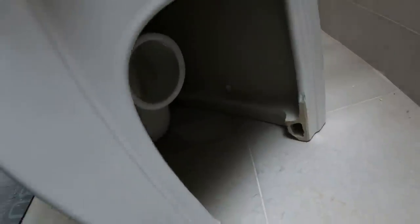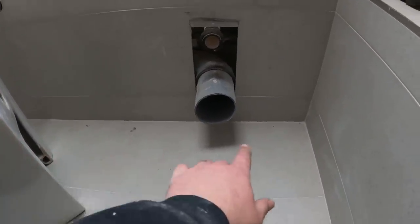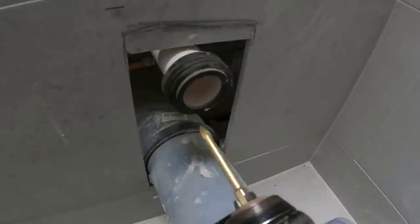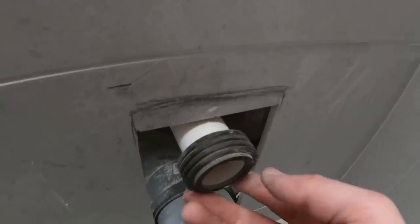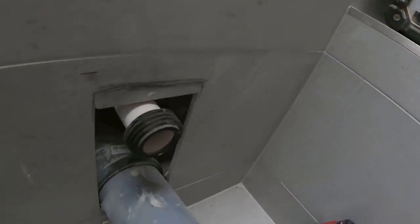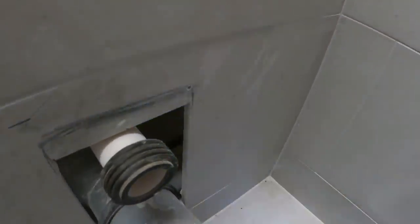The pan sits — the actual outlet for the pan sits quite far in. Some of you may remember there's underfloor heating going through here, but we did work out exactly where the pan's fixing. I think the underfloor heating finishes about here, so we've got all that room there to fix — not a problem. Let's get this pan into position. I'm going to stitch drill the ladder holes along there, and then we can just tap that and it'll come out. It'll just give us enough room to lift that flush pipe up — it's only probably half an inch or so — just to line up with the back of the pan. These drill bits are perfect as long as you keep them wet.